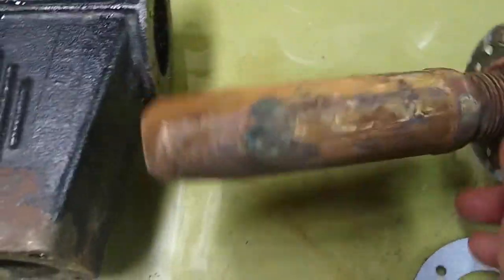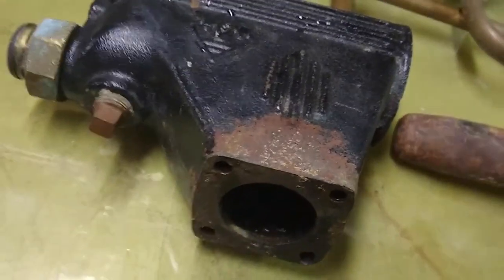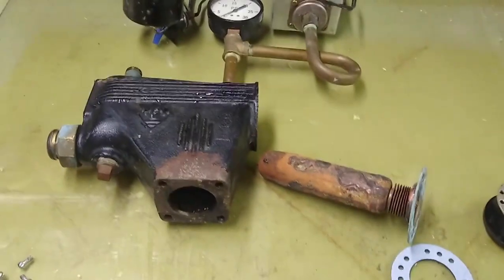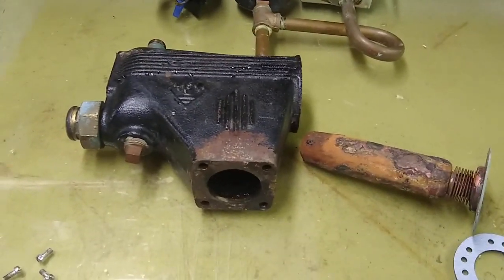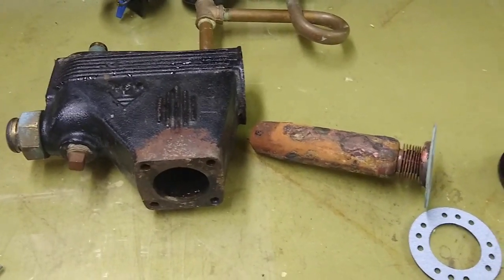Once I got some scale removed, I had removed this whole thing from the boiler so I could work on it. I removed enough of the scale from around the float that it did move a little bit, but it wasn't moving far enough to operate the cam on the switch. So I looked online for a new part and found it was going to cost $500 or $600 to replace this low-water cutoff. So I went down to my local plumbing supply house that I've been doing business with for 38 years — that's how old this switch is.